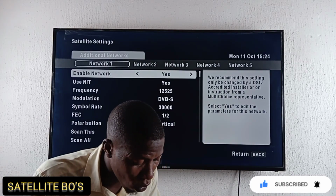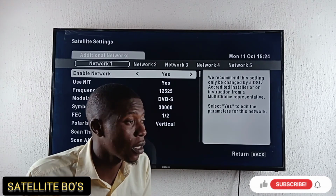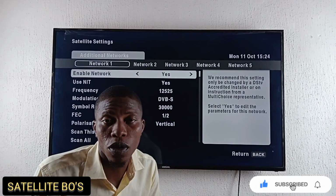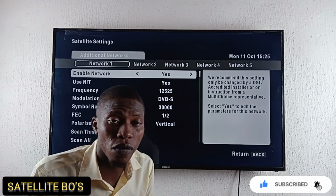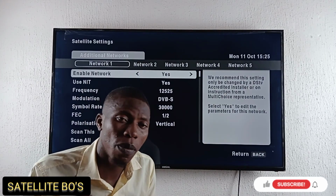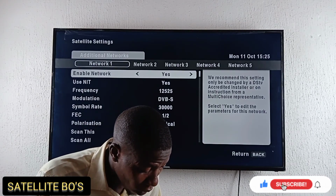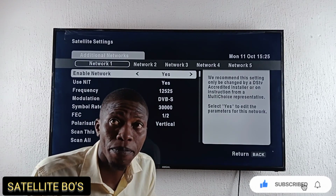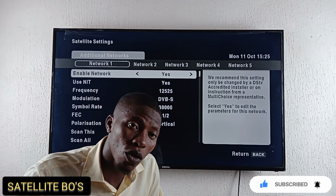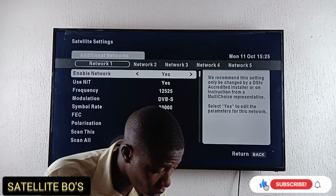Say not working, bro. Showing parameters are probably incorrect. That means you are actually entering the wrong parameters for the satellite you have installed on your dish. I think I already showed you on this video how to get your parameters. All right, so make sure the parameters you are entering are the parameters for the satellite you installed. You can also get your parameters from lyngsat.com. If you know the satellite, maybe it's 28, you can just type on Google 28E Lyngsat. So you get all your frequencies on that satellite.